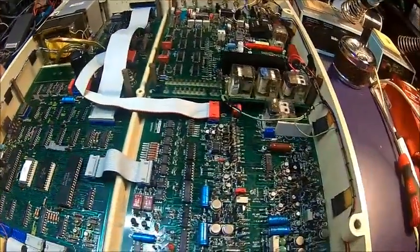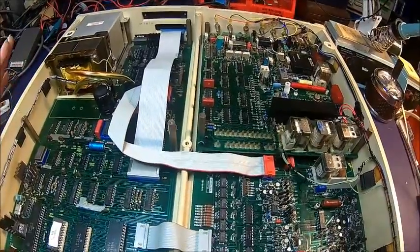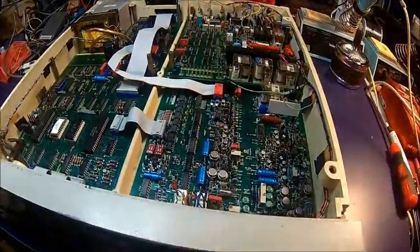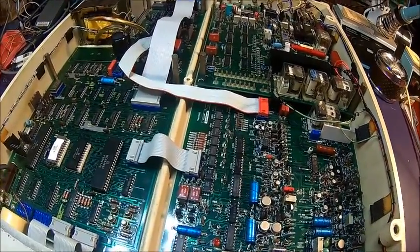The reason why I like it is because it's got HPIB or GPIB bus. They're a bit fancy about the bus though — you can't have a Solartron meter and any Hewlett Packard instrument on the same bus. I have no idea why, but as soon as they're on the same bus it's not going to work anymore.